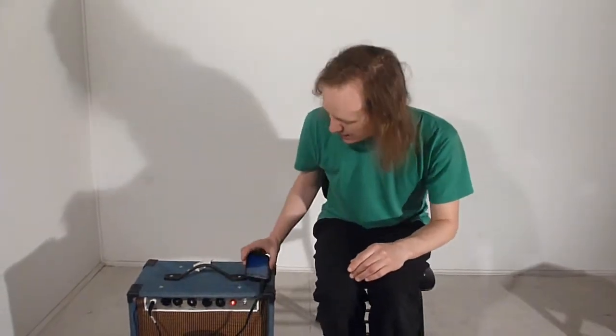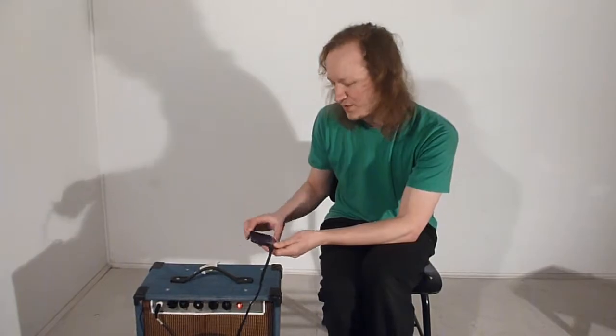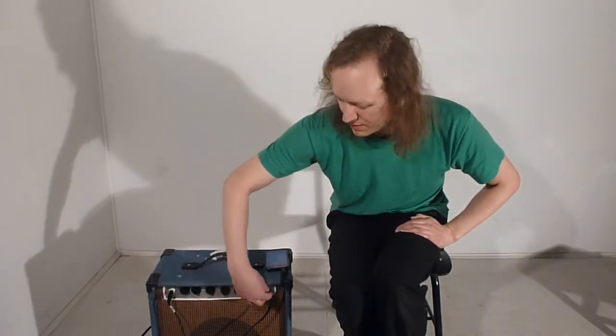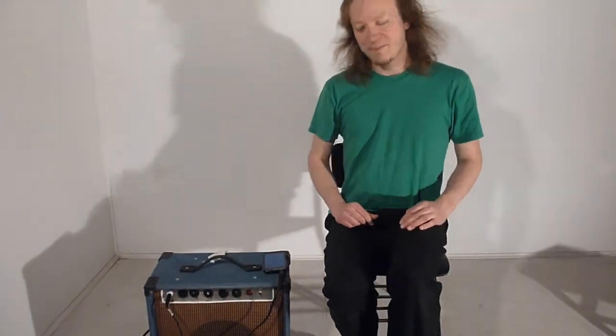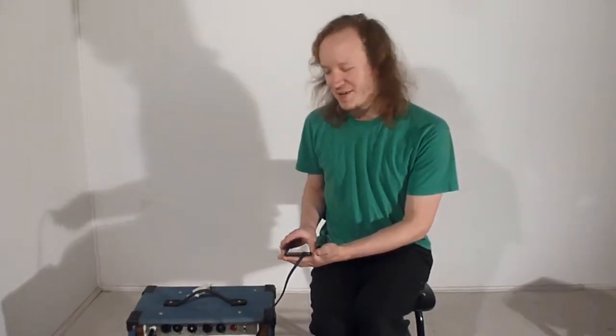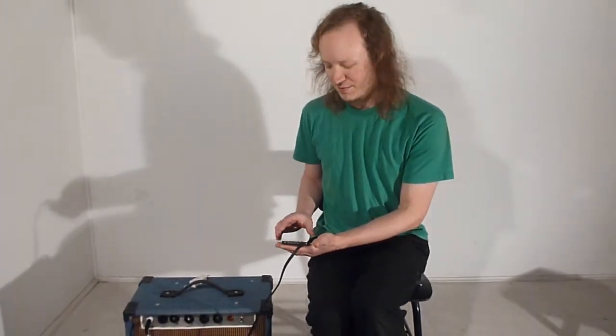Clipping is very different from a small amount of hair or a little bit of distortion. There's a point where it very suddenly goes from somewhat clean to very not clean. For lack of a better word, the amp starts sounding angry. Keep in mind we're on the clean channel here. Find the point that's as loud as you can get it without it going into hard clipping — that's what you want.